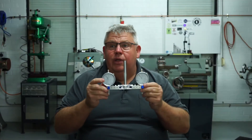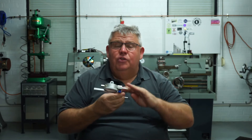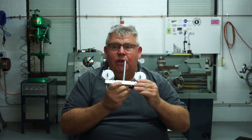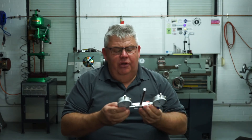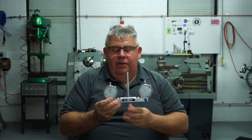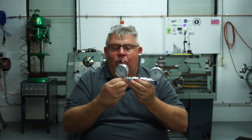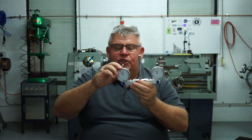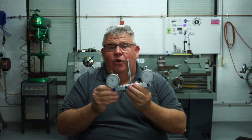Here's the tool - the spindle square - and I think James has done a very nice job of it. It looks like it's all been CNC machined, it's got a very high polish on it. It's got some nice little engraving over the back. I think he's used the drag tool he supplied in here. What I particularly like about it is it has these ribs on the top, and those ribs are to lock in the dial gauge - the DTI will come in here and actually sit on those little ledges, and you can lock it in. Pretty cool.